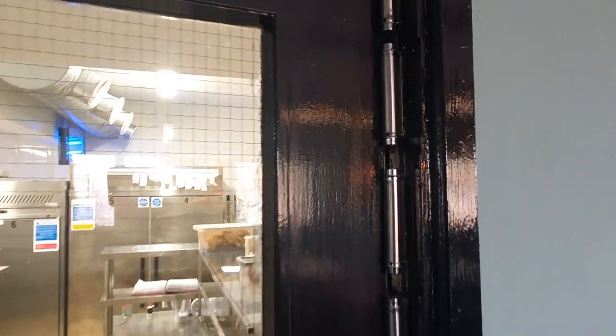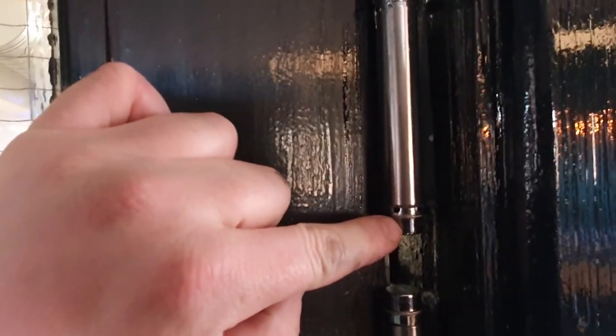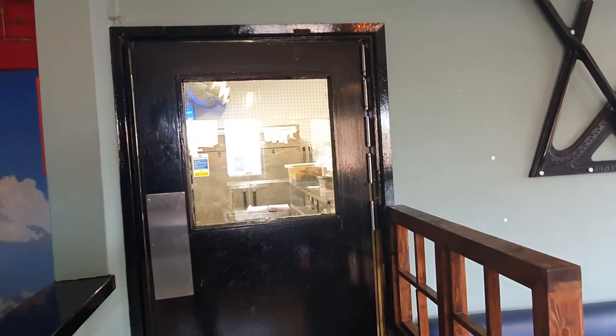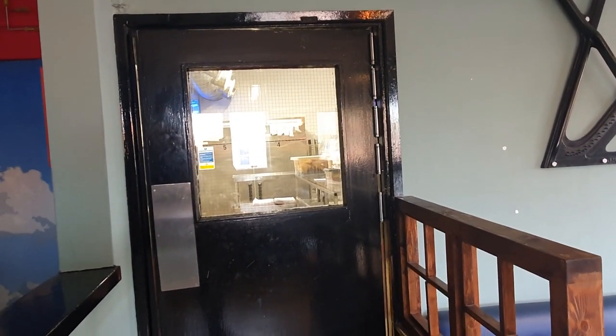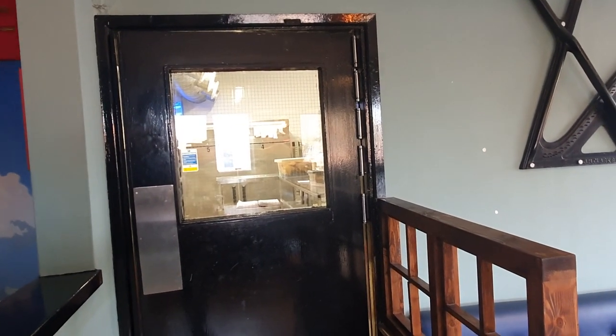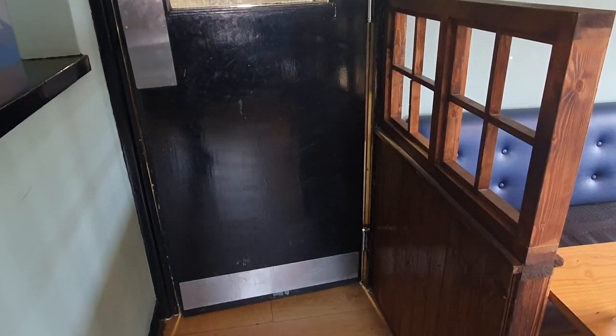Because this is a big heavy fire door, we've got one, two, three, four, five hinges supporting the weight, plus six counting the one at the bottom. Usually it's alright, but when I went to adjust it this morning I found it difficult because we've got some wear on some of these holes - because unbeknownst to me I've installed them upside down. Hopefully we can take them off, spin them around, and get another couple of years out of them before we have to upgrade.